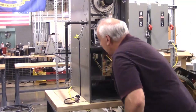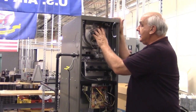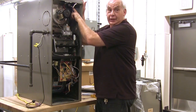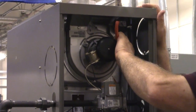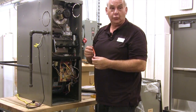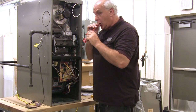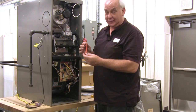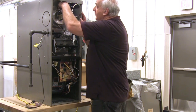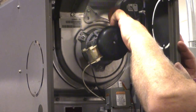We're going to leave the door off for now and move up to the upper part of the furnace. This is an inducer motor. There's a hose here that runs from the motor to a pressure switch — we want to take that hose off. It can become plugged up with water and condensation, rust, and dirt. So we simply blow through the hose to make sure it's clean. If it's not, then we take a piece of wire and run it through there to clean it. Then we put the hose back on the pressure switch and back on the inducer motor.